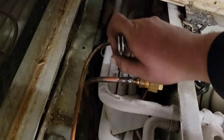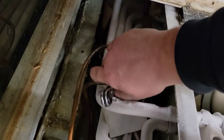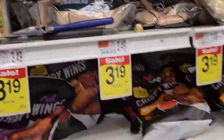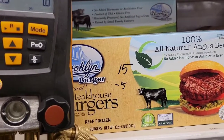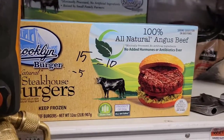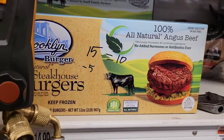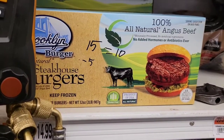We're going to look over here. Previously I got 15 and negative 5, and now I'm going to see what temperature I get and average it out — that would equal the superheat. So that's around 10, because this valve is hunting. This valve might be too big or too small. Typically when it's too big it hunts, but there are all kinds of reasons. Normally it would just give you a steady value and you'd slowly turn it, but right now it's not doing that — so when it's hunting, we average it.